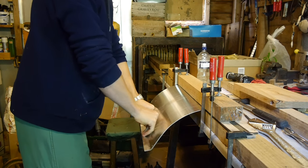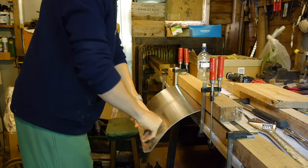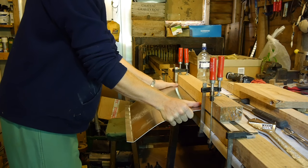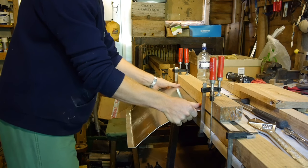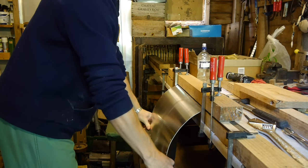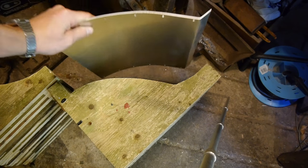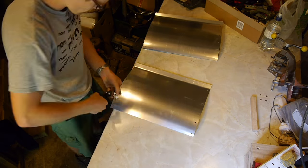It is 1.5 millimeters by the way and I managed to get a good alloy for not that much more cost wise. I originally tried shaping them using a press I made out of some scrap plywood, but the aluminium sprung back so much that when I released it, it almost had no effect. It did turn out to be kind of useful for checking the shape as I went though.